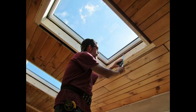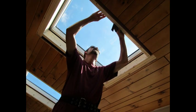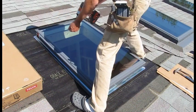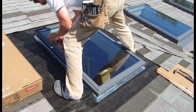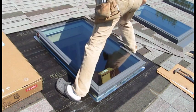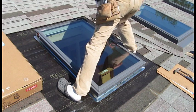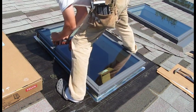It's very important to make sure that your squared rough opening matches the skylight, so put center marks on each side of the skylight and align it with the center marks from the ceiling. Once centered, hop outside and fasten. I use exterior flathead screws instead of nails — less chance of the skylight slipping. Screw from side to side and then opposite corners.